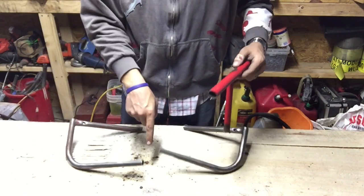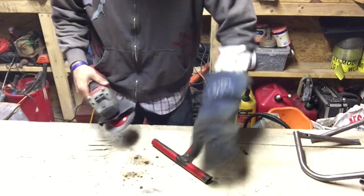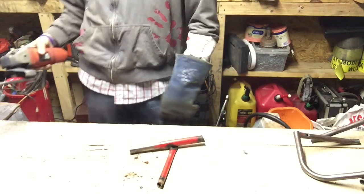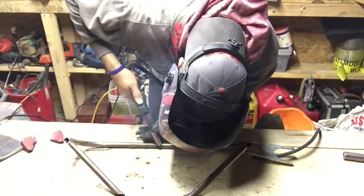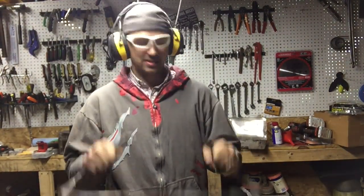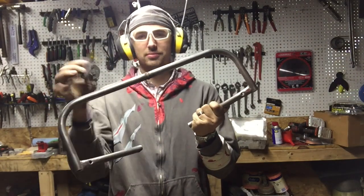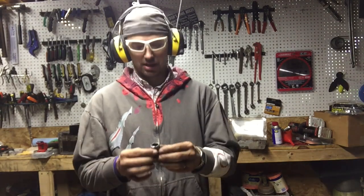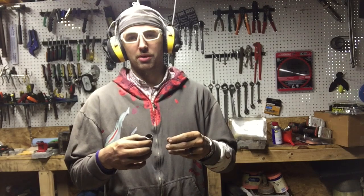All right. So since we're doing a butt joint right here, I'm gonna cut this tubing, put a section there. Goes to prove to you, I'm an idiot. I tack weld this, and I was like, oh, I'll just slide it over when I'm done tack welding. Yeah, how am I gonna do that? So now I'm gonna have to either cut that butt weld, which I'm not gonna do, and I have to slit this down both sides, put it around it, and then weld it that way.